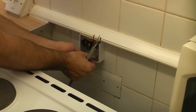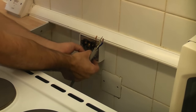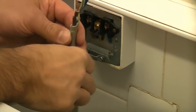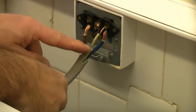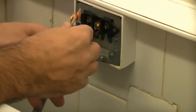So we're just going to undo the grip and we've got a gap for the cable to go through. When you put this cable through you need to get it the correct way around. You don't want to get the live and the neutral on the wrong side because it is difficult to manipulate these wires with them being so thick.